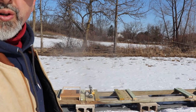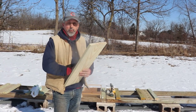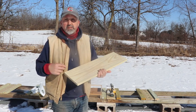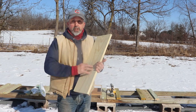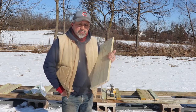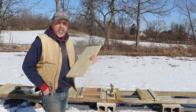I didn't bring my cordless mic out here with me. In between each hive, I've got a piece of 1x8. Now this is all treated lumber — you want to use treated lumber. Don't just buy pine; yeah, it's cheaper, but it's going to rot. You want to buy treated lumber. It's made for decks, for being outside in the weather. It will discolor — it's green right now. That's the treatment they put in it. Maybe in 20 years it'll rot, but you don't want to use straight pine.